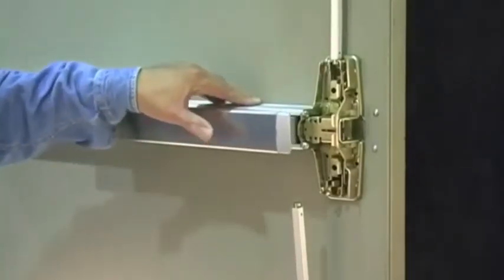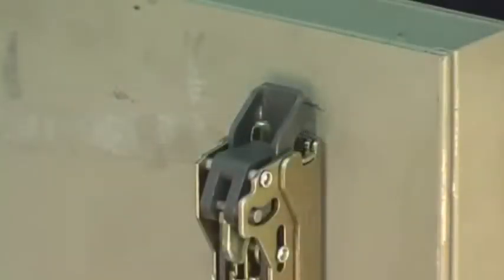Cycle the door. Check the top of the door to determine if the top latch is fully retracted. The latch bolt should be flush with the top of the latch while the dead latching triggers are extended. If the latch bolt is not fully retracted, you need to adjust the top rod.